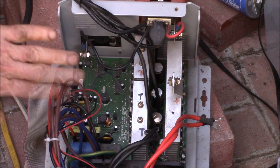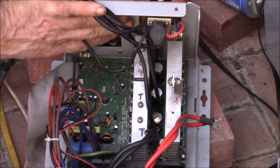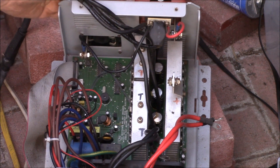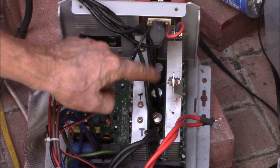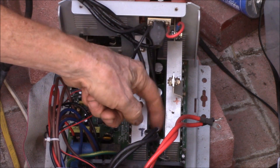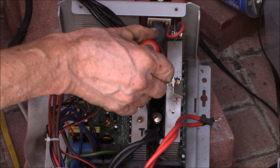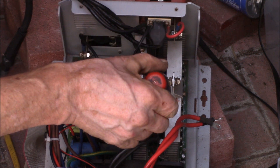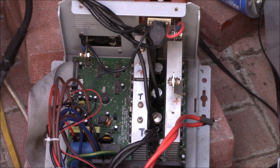There are perforations down here at the end of the case, and an equal number up top. I think most of the airflow is coming in the top because the fan is pushing air out over the transformer. So my plan is to block off these top fins so no air comes in there and force all the air through the bottom vent, pulling it through these heat sinks to keep things cooler. The third capacitor — which would be the hottest — is the one that blew.